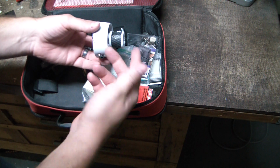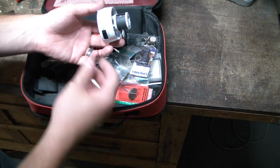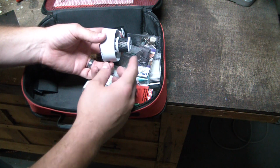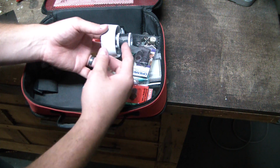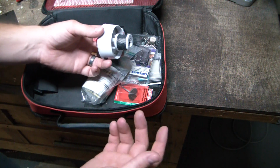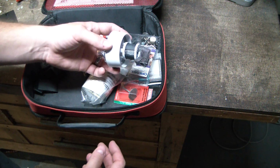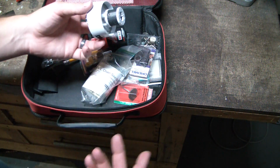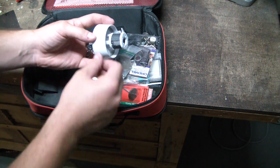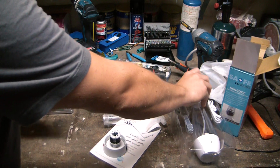Now those little nicks won't hurt it. Titanium, when used as an anode, passivates. It forms a passive layer, an inert layer to electrolysis. So that'll just turn a cool color. That's actually how you get those titanium smoking apparatuses that have the cool rainbow colors, if you're familiar with such things. Or sunglass frames, or something of that sort, you know? Just earrings. They do titanium earrings. Enough about titanium. Now let's test the other one while we got the magnets out here.